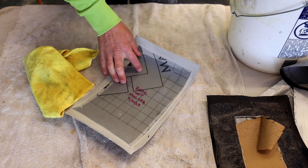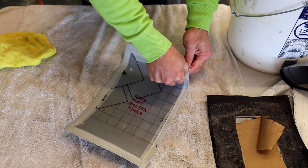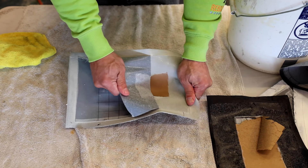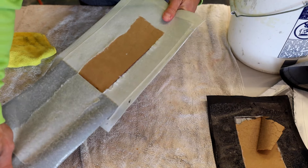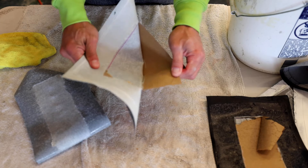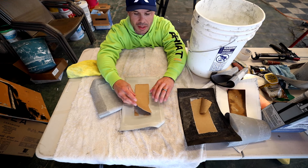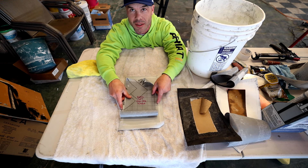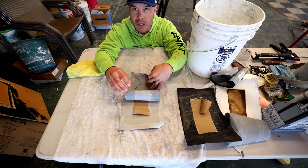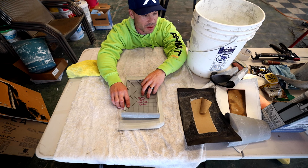This black private label one — see how well it bonded, completely peeled the fleece off, and we are bone dry in the middle. Cardboard is completely dry — that one worked! Now we are doing the Rapid Set. Completely bone dry. The sealant cured up fully under bands of sheet membrane, immediately under water. These were placed directly after I applied the sealant, put the top on, and immediately put in the water, and they've been sitting for over seven days. This is really cool.